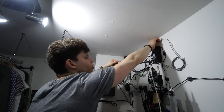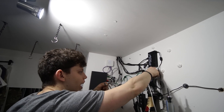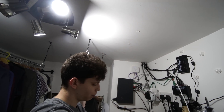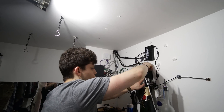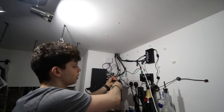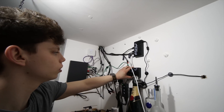Access Point 3 installed. I need to assemble all of the SFP modules and deal with the old router that was installed here. I've got it all cable managed extremely well. There is our SFP port, the SFP module, and then these are the three cables that go to the three access points. These will carry the PoE power over ethernet for those access points, and this is the old router which just comes off the wall.